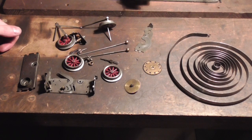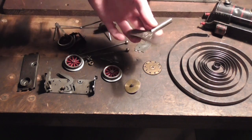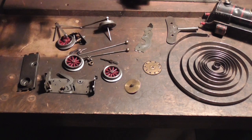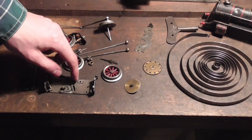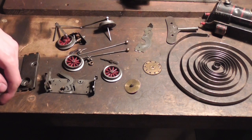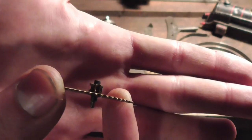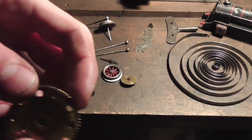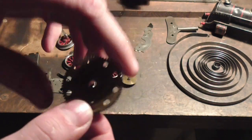This was once a steam locomotive — one of those wind-up toys — and it's completely munted. It's in my shop to get repaired, and I thought it was going to be one of those bearings that wore out to become elliptical so the gears aren't touching anymore — no big deal. Upon disassembly I noticed it's actually the gears that have had some material removed. If you look at the profile you can see that's eaten through quite a bit, and the corresponding gear has the teeth bent over, so there is no saving that.